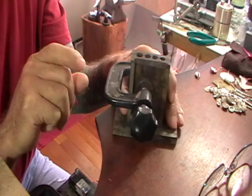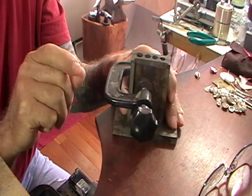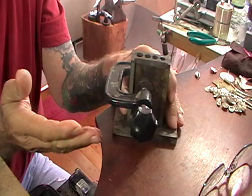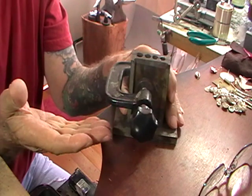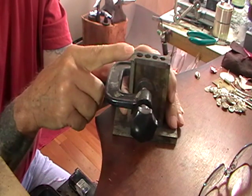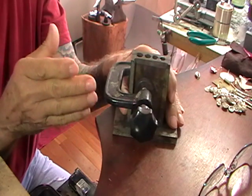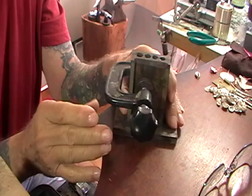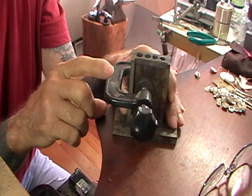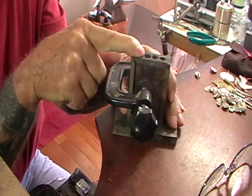The specific gravity of water is 1, meaning 1 cubic centimeter of water weighs 1 gram. Once you get that figured out — brass is 8.8, so 8.8 grams per cubic centimeter. As you can tell, the same volume of different metals will be radically different weights. So you need to know the metal and you need to know the volume.